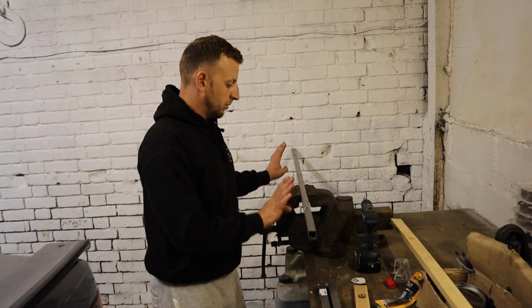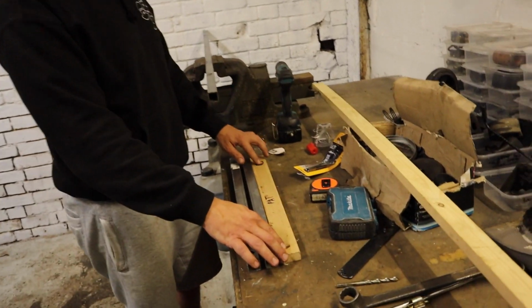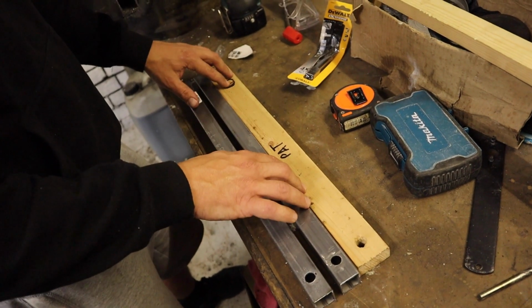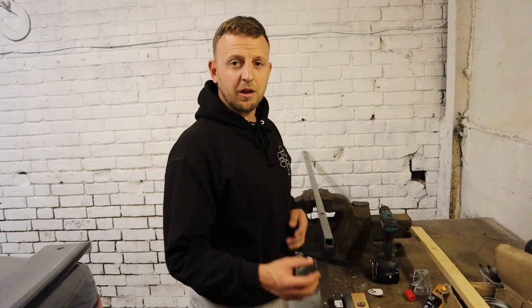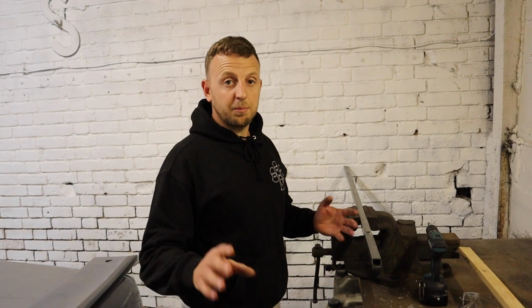So we've got the steel now, cut to the same size as the wooden pattern. We've drilled that, that's our marking point on the rear suspension shock bump stop, the cone bit on there. What we're going to do is flip that shell on its side, get this all bolted up, and remark it so it's correct. Then we chop that out so it sits nice, get it all bolted up and straight, tack weld that, and bring it in here to make sure it all works on this. Shouldn't be any difference at the end of the day. Then that'll be this part done, so we can finish cutting out the rest of it. And we know 100% when we bolt that back axle up, it's in the right position, not the wrong position.